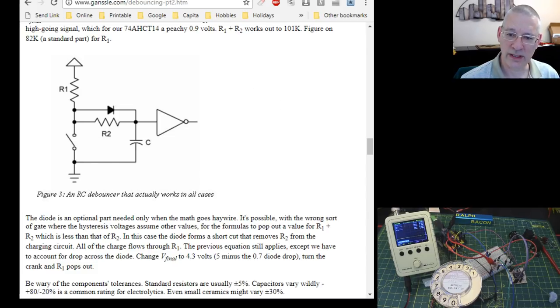So does that mean then that we should now be able to eliminate any kind of software treatment of that bounce? Because after all, if the pulse is now coming from a Schmitt trigger, what exactly are we debouncing now in software? And the answer is, of course, nothing. So we can eliminate all that. So let's have a look at the code.